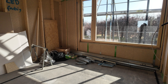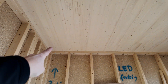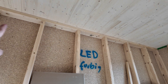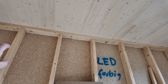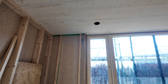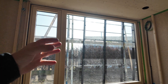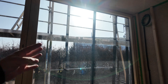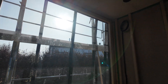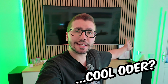Here in the living room there will be different lighting circuits — there will be these spots as well, some nice hung 230V LED lamps, and there will be a color LED strip in the wall with an aluminum profile shining on the ceiling giving a super nice effect. Also here, for the windows, automatic shading based on the sun — in summer the shade will automatically go down.